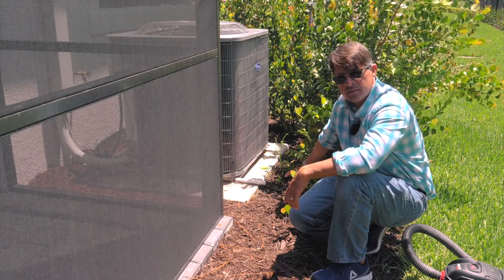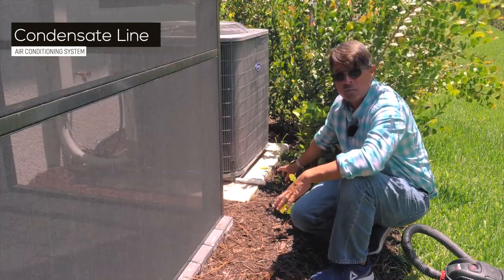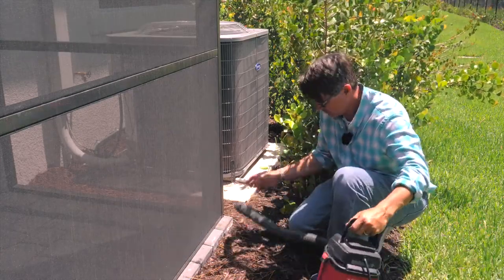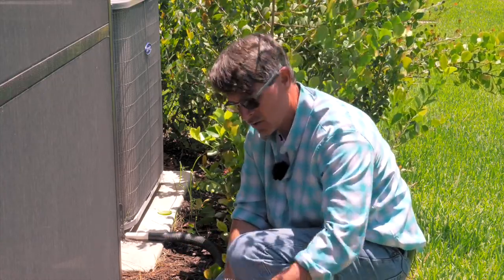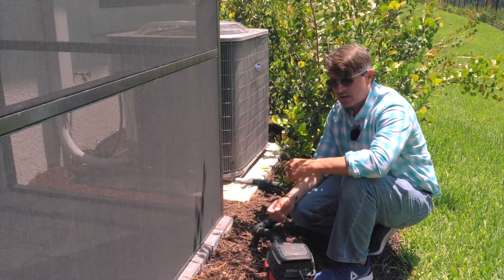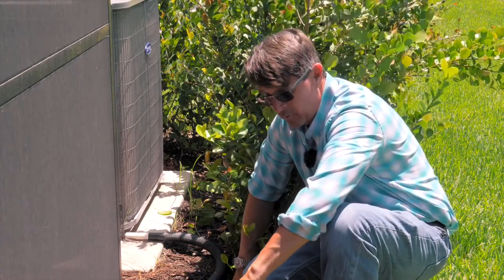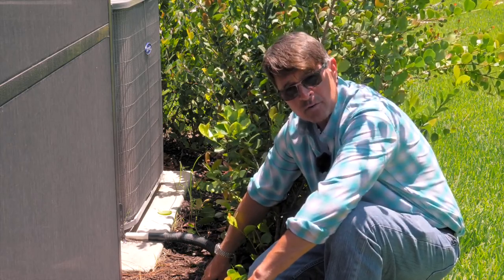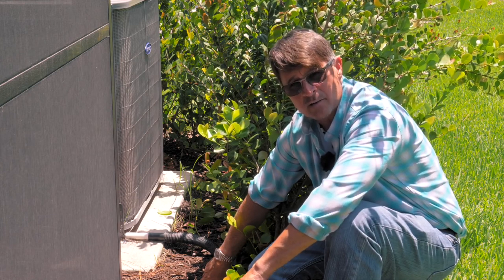This is where the condensate line we discussed at the air handler comes out. Water will be dripping out of here from the air handler. This condensate line you will need to maintain — it is very simple to do. You get a small vacuum such as this, simply hook it up to the condensate line, placing it over it like that, plug the vacuum in, turn the vacuum on, and let it run for about five minutes. What that's doing is taking out any sludge that fills in this line. They do fill with sludge. If you do not want to perform this yourself, you should employ a company to do it for you. If you do not employ a company, you will be calling someone at some point for an emergency service. These lines do fill up with sludge and it is simply a maintenance item that something needs to be done about.